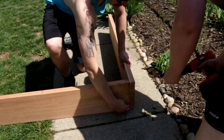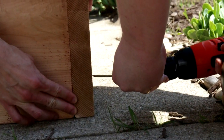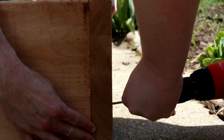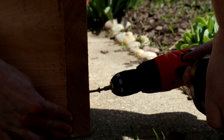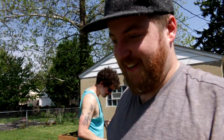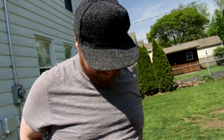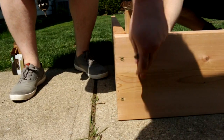Something I learned from Kevin is that you need to hold the drill at a 90-degree angle from what you're drilling. Alright, so that's our first set — we might have to wait for the drill to charge at some point, because I forgot to charge it. I'm what's called dumb. Now we're going to attach the leg to the post — basically just square it up with the corner, and we're going to put two screws on each side.